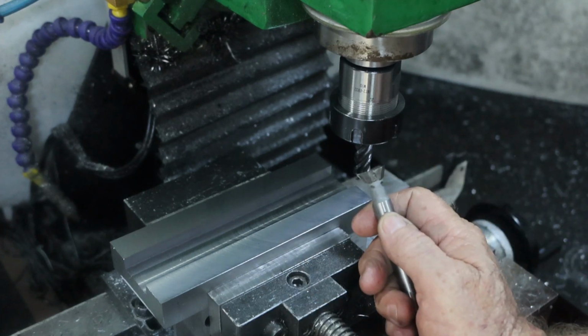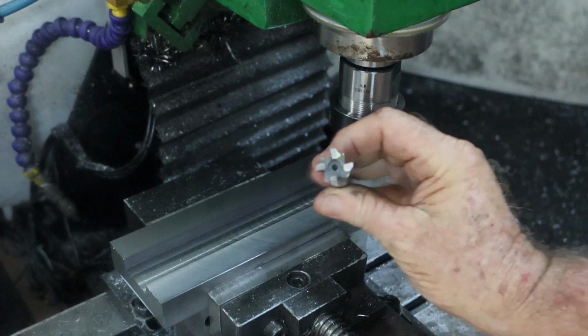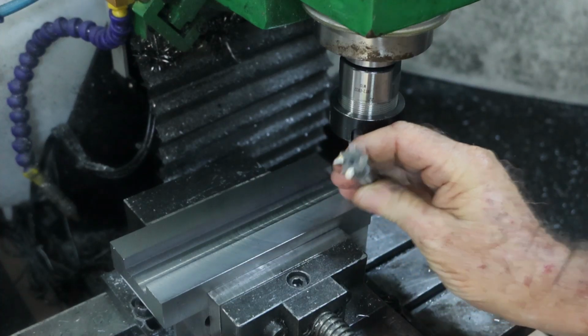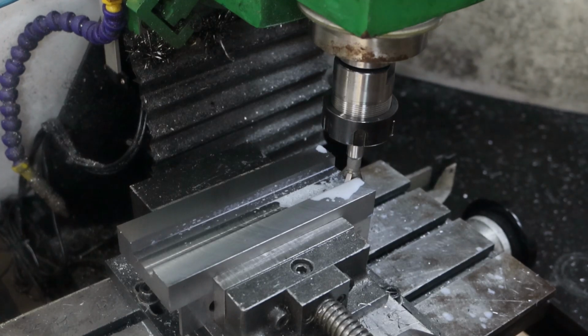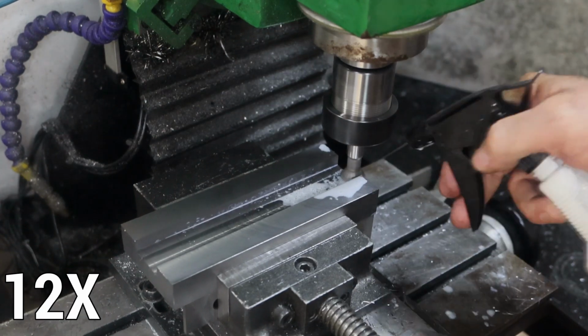It's getting late in the day, but I might stick this in there and just have a look. I'm a little worried that with only 4 cutting teeth on there, it might be a bit on the noisy side, but I'll get back to you. Alrighty, so I've got that set for a 1mm depth of cut. I just made a little cut, it's not too bad, but I suspect as I get in deeper it's going to make more noise if I keep trying to cut 1mm cuts.